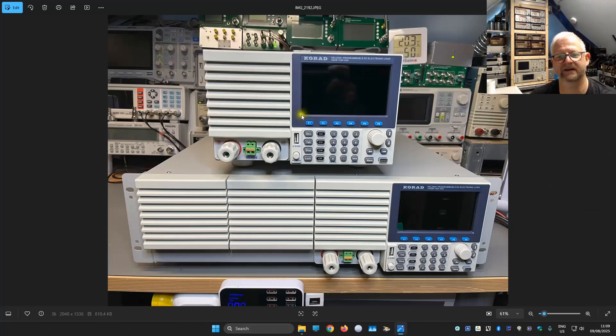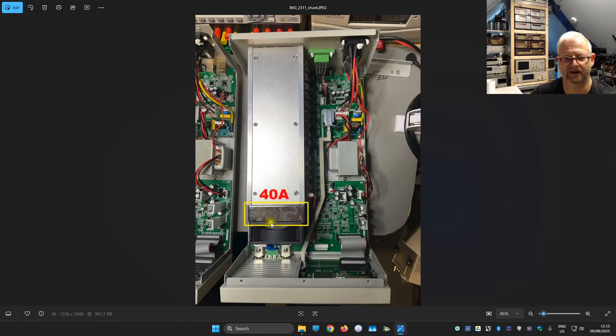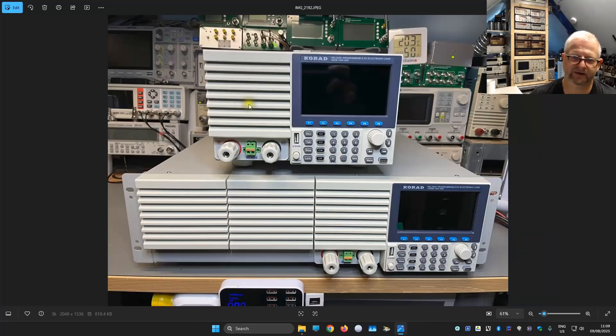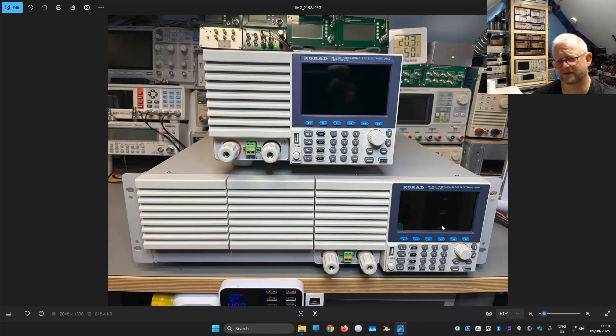This is the older version — the 2020 and the 2030. The control unit is on one side and the power dissipation unit is on the other side. On the right side you have the control unit, and on the left you have the main 500-watt unit with the shunt right in there. The 300 and 500 watt are sort of the same — the 300 is just less populated. And this is the 2040 and 2050: more or less the same, going in units of 500 watts.